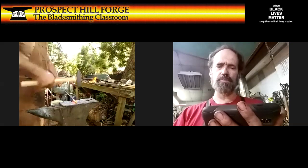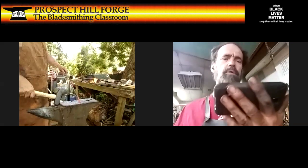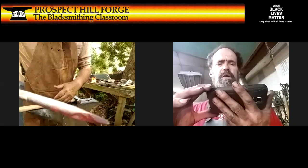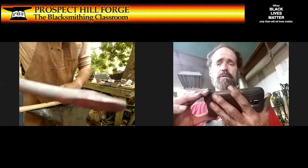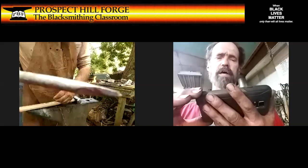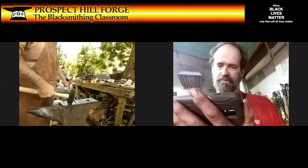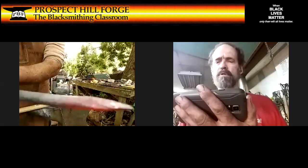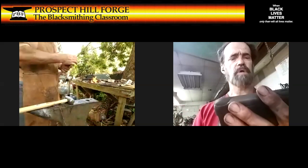Okay. Yeah. Hopefully you don't flatten it too much at once. Actually, can you show me that in the camera? Let me close. All right, and rotate a little. All right, lift up just a hair. There you go. Okay, yeah, looking pretty good. Okay, so you see how it's got a wide side and a narrow side? You're gonna hit the narrow side next. Okay, warm it up, do it again. Not unreasonable. As you do the rounding, you can get that tip a little pointier. A pointier tip will curl better.